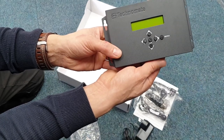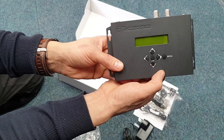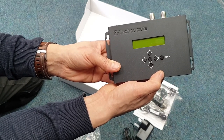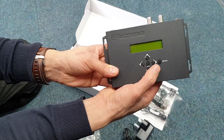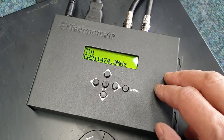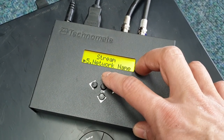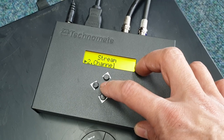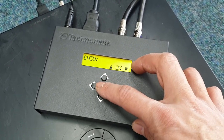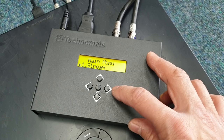So that's the front of the device. We'll turn it on in a moment. The main thing you do is just select the RF frequency channel that you're going to tune it into. I think it will be defaulted to 21. In our area, our spare frequency ranges from 21 to 69, but our spare frequency is generally 39 or 49, so I shall try 39 first. So I've got the device turned on and powered up. The first thing I'm going to do is set the RF distribution channel. I go menu, OK for stream, and it's the channel. At the moment it is on 21 — that is not spare here. So 39 is my desired channel, that is channel 39 or 618 megahertz. Press OK and press menu to come out of it. So TV1 channel 39.